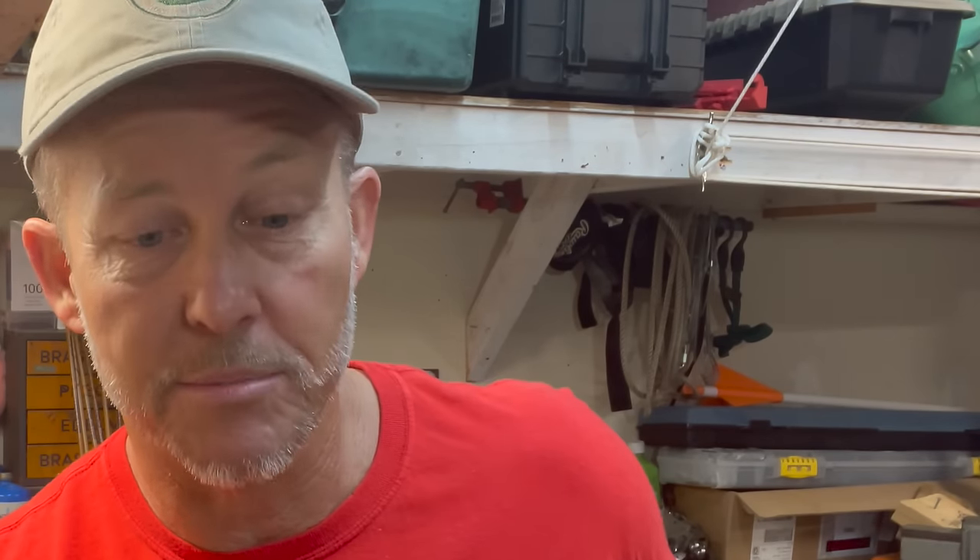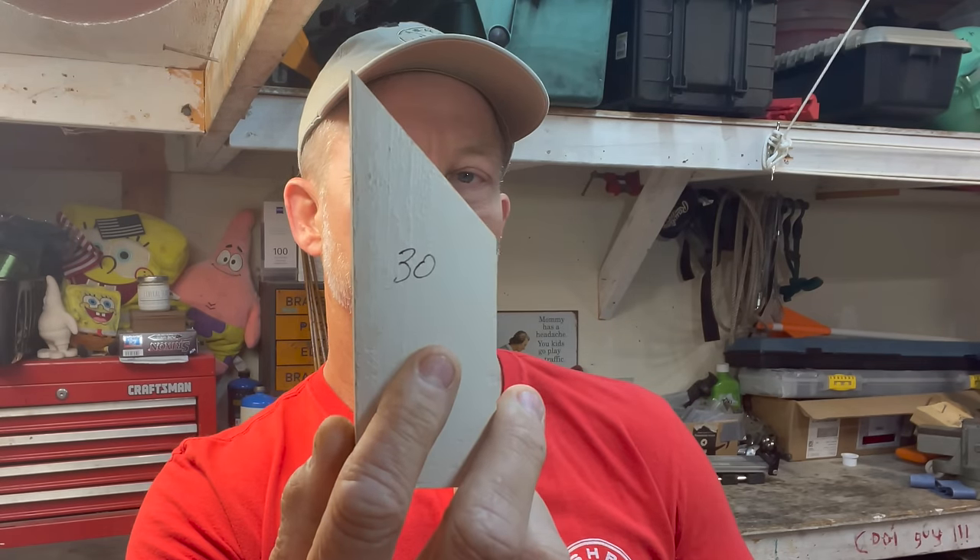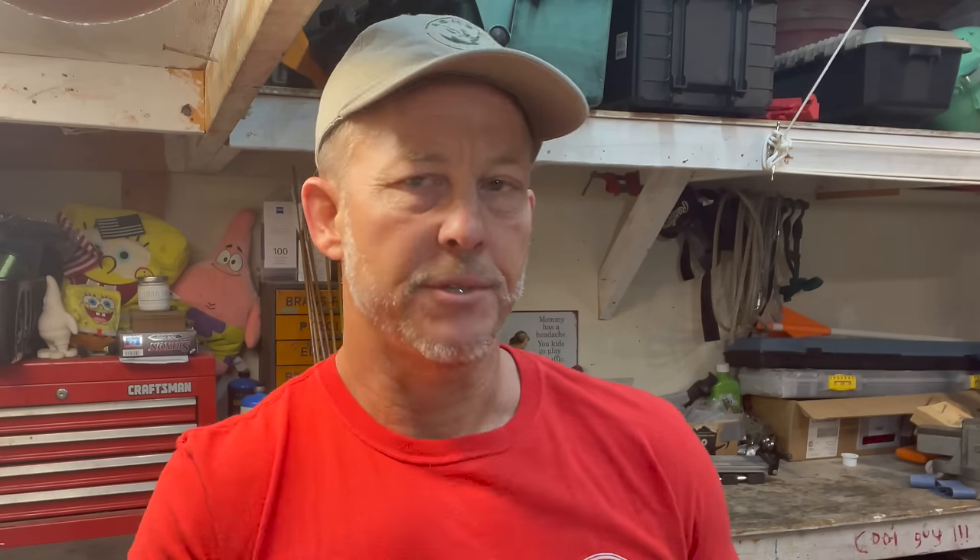We're seeing these things in outcomes and making assumptions — and I'll clearly state that's an assumption, more to come. Probably one of the most misunderstood things about a cutting device is that you want the edge to be thin. So what I've done is cut some very simple boards. I was doing trim work at my house, had the saw, and figured why not make these. I've got a 20-degree bevel, a 30-degree bevel, and a 40-degree bevel.